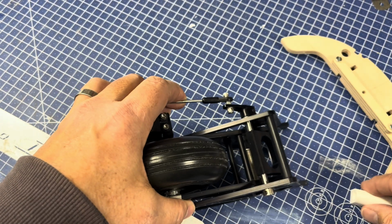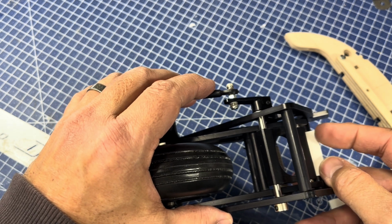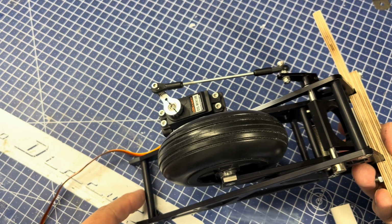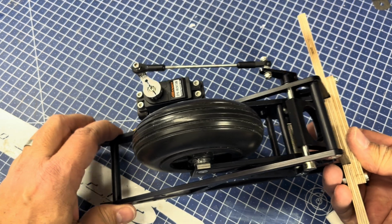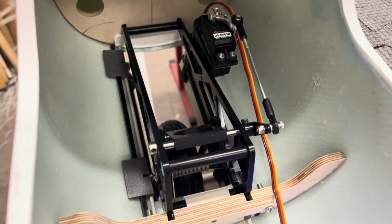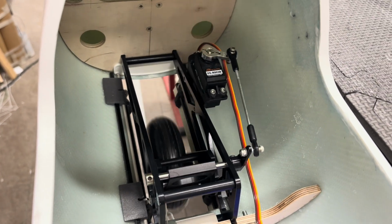And the landing gear has this plastic part. In fact, this one is a little bit too big here, but the 3 millimeters one is just 3 millimeters extra here. It serves to hold this part against the wood and to get it flush with this part like this. The gear will be held in the back with this one, and held in the front with the white 3D print part, and you cannot move forward or back. The gear is inside the glider, and needs to be reinforced, of course, with the micro balloon and the epoxy, but the gear is working perfectly.